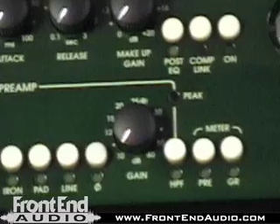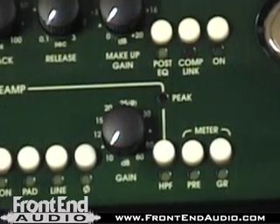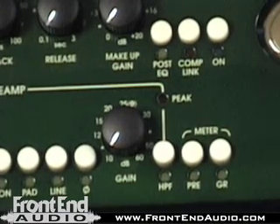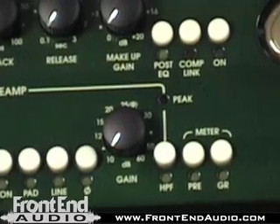There's 60 dB of gain available. The microphone preamp is a Burr-Brown design called the INA-217. It is a low-distortion mic pre with great detail, a very robust sound, and will do as well or better than most good-grade console microphone pres.